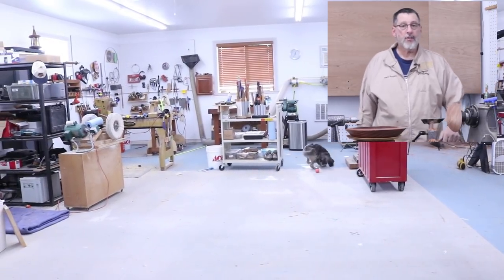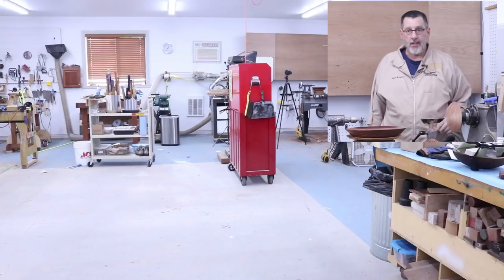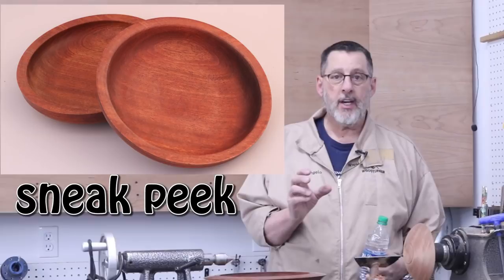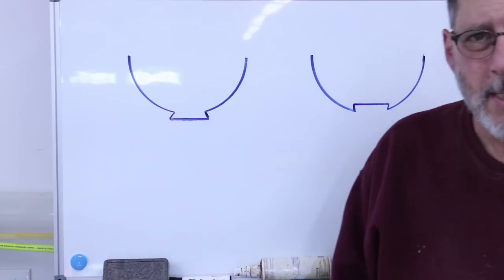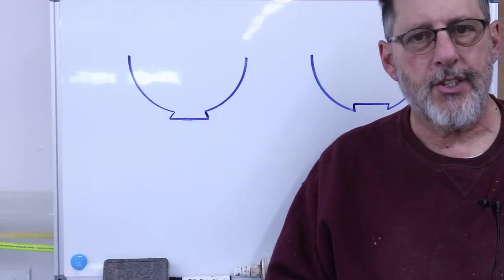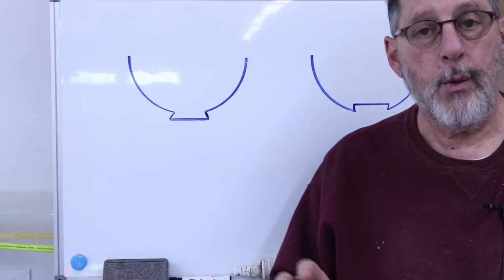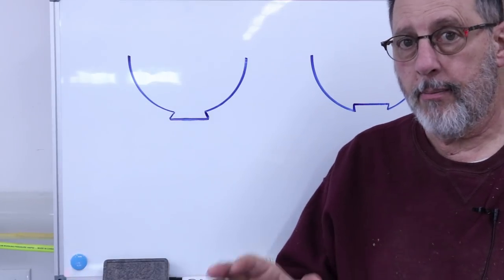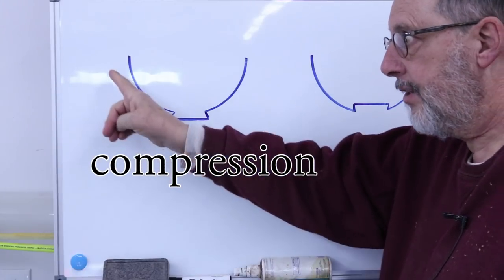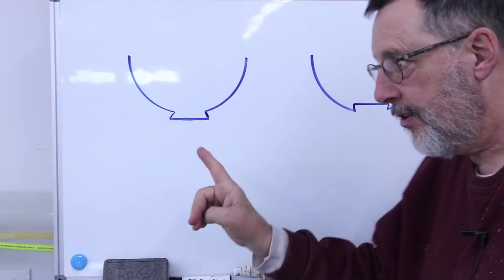What inspired me to do this video — I was watching YouTube and someone was making a bowl, but they had an expansion recess on the bottom. And I got to thinking, that's an important issue. Do you use a compression fixing or an expansion recess on your project? I really want to narrow down the scope of this video. It's not necessarily about how to form either fixing — it's why you would do one or the other. I think the spigot or the tenon is better in most cases because you can have the outside form of a vessel, a bowl, or a hollow form completed except for the bottom area.